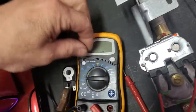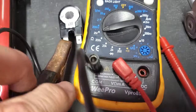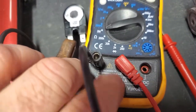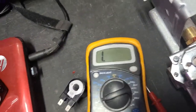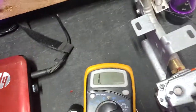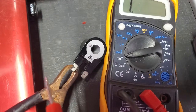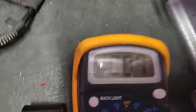All right, so first off, we're going to put it on ohms — the upside-down horseshoe. See the upside-down horseshoe? Don't worry about the rest of them. We're going to measure this. I've got one with an alligator clip on it holding it. We've got an open circuit because it is — it's from here to this one. Watch, I'll touch it. Now the circuit's complete.